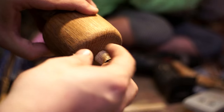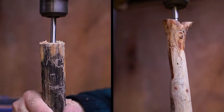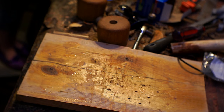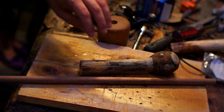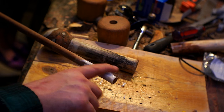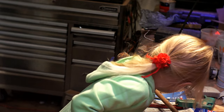Now I had to figure out a new way to mount the head. I figured the only really strong way was to introduce another piece of wood, so I got a Forstner bit and drilled a hole as far down as it would go into the handle. I had found a piece of walnut dowel in my scrap bin — it wasn't quite big enough for the hole in the head but I figured I could use a little two-part epoxy and drizzle it in over the top to fill any voids.